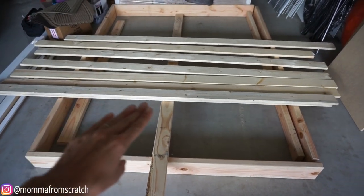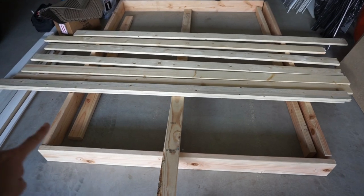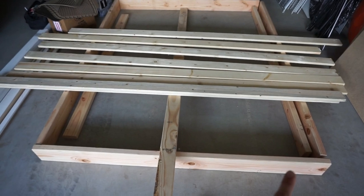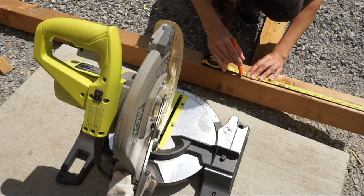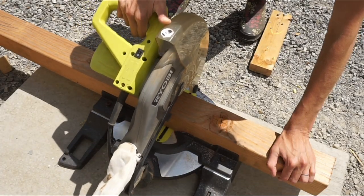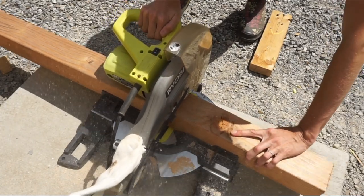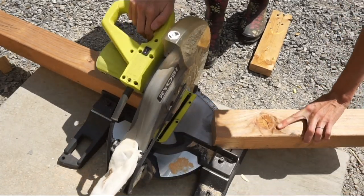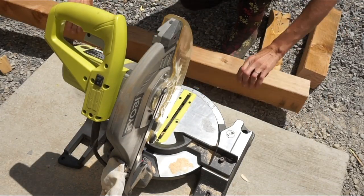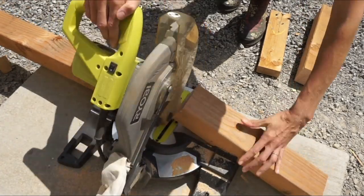It's a simple rectangle. The head and footboard are the same size. Then you're going to have five boards — the rails on the inside and outside are all the same size. Then you have the legs and the slats that hold your mattress up, all the same size. I'll go over all the cuts in a minute. Right now I'm using my saw to make cuts. All the legs I'm making 17 inches long — they're four by fours, and I got one four-by-four-by-ten-foot board since I need five legs total: four for the outside and one for the middle support.